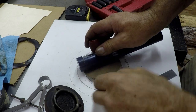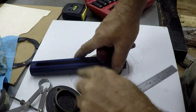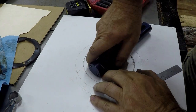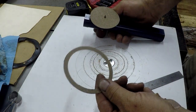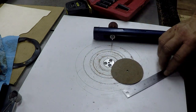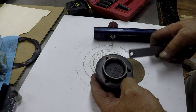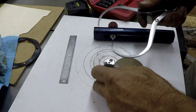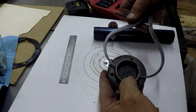This is the center from the other gasket — that's a gasket, good for something, throw it in the box. Now something like this, it's always really best to punch the holes first if you can lay it out. But I can do this gentle enough to get those without splitting the gasket, because I don't have the measurements — I don't know the bolt circle, I had to figure it out. But I can do this without it.